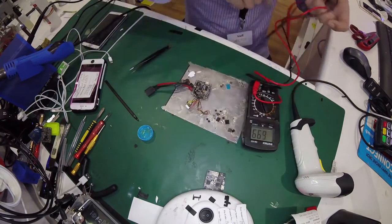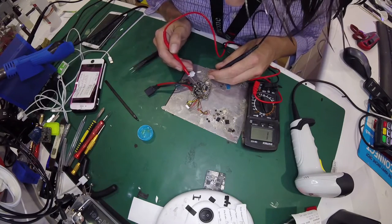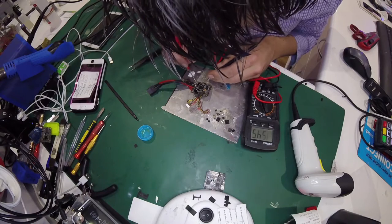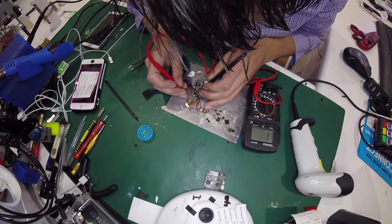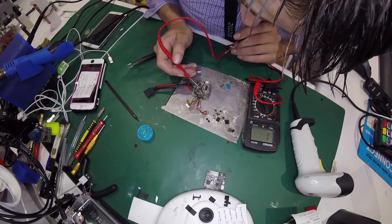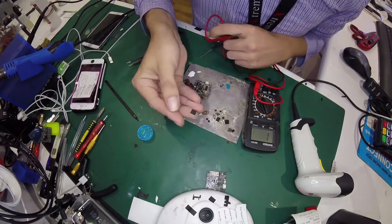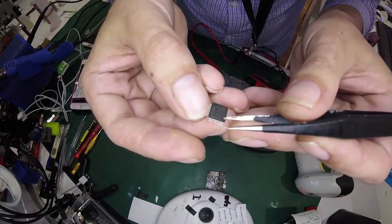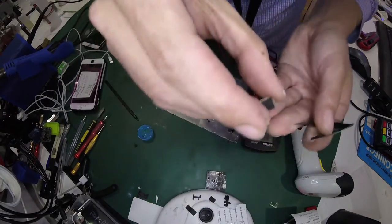Now it's time to check. Before, I had a short between VCC in and ground on the CPU — 3 volt and ground. Woohoo — no shorts! Motor 1 output was shorted to ground before. Awesome — no blown up or shorted traces between the CPU. I'm pretty sure that swapping that CPU out did the job. Here's the old one — over this side there's a bit of a hole taken out of it, and internally it's been fused. It got blown the f*** up.